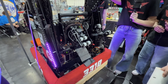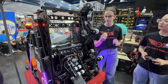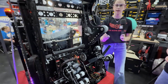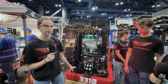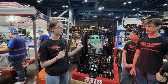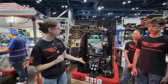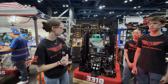We used an X44 motor to get the wheels to spin, and the elevator lifts this piece up. On our coral scorer, we originally had it set at a 25-degree angle, but this angle was not as efficient to score on L2, L3, and L4 — because L4 is oriented like this and L2 and L3 are like this. So we adjusted it to a 35-degree angle to allow for more efficient scoring on all levels and better results in our matches.